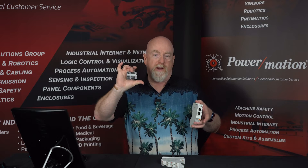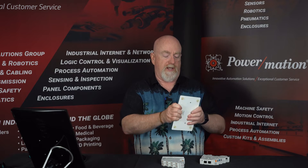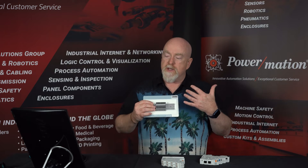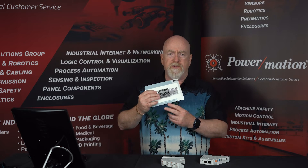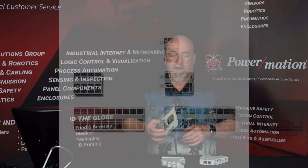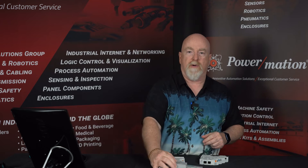The power module delivers power to the power rail, which simply clips onto your DIN rail — I pull this up, clip it on, snap it in, and the power rail is ready to go. There are a couple of different power rails available: a base power rail in an 8-slot version and a 20-slot version for larger systems. If you need to go beyond that, there are expansion modules available in 4, 8, and 20 channel sizes. Those expansion modules clip together at the end of the base module, with power clips inserted to transfer power across the backplane.